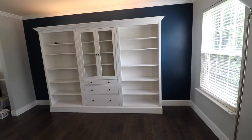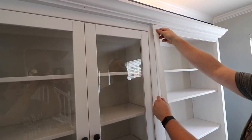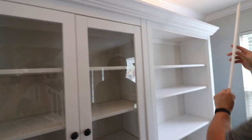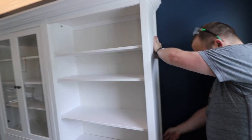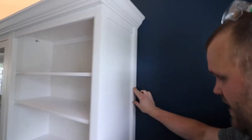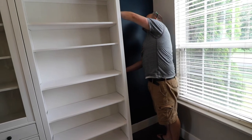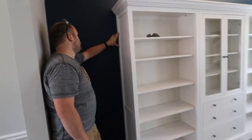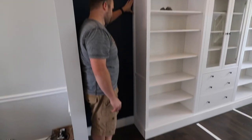Getting rid of the floor gaps is the big difference. We got the lattice board cut for this length - just a little bit too long for this one. These are very similar in sizes, one was just higher than the other. This is a 'do your best and caulk the rest' situation because the wall is curved relative to it. We got all the boards measured and picked out for their specific spots. Now we're just going to nail them up, then we'll be finished with all our nailing. Then it'll just be sticking down the light strips at the top and filling the nail holes with wood putty and painting it white.